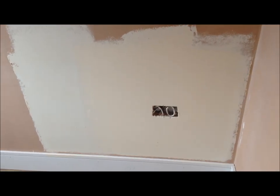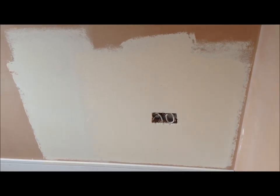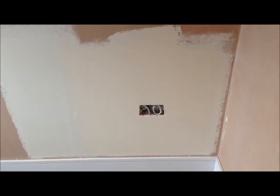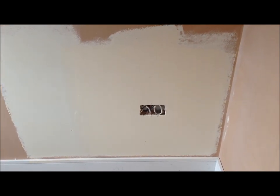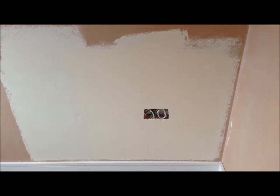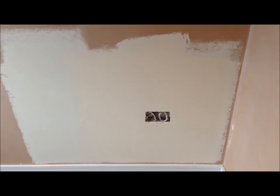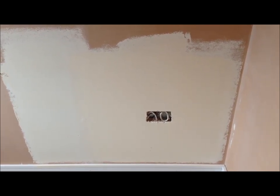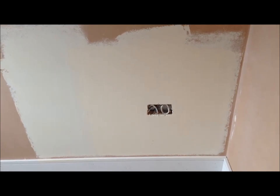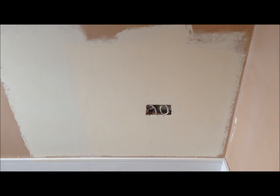Another section is round plugs — I've highlighted these so you can see. There's no second fixing going on, which means the plug covers have not been put on yet. If you can double coat that section where the plugs go, nine times out of ten — if the sparky doesn't damage the plasterwork around that area — you'll be able to just roll up to the plug area or quickly cut it in, and the finish will be near enough perfect.